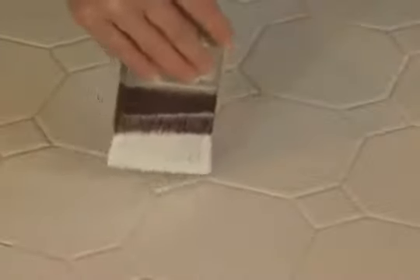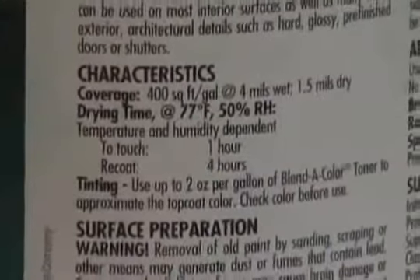The grooves in the tile can be tricky to paint. To paint the grooves and get extra paint out of the grooves, take the tip of your paint brush and run it along the groove. Then go over the tile with a light brush stroke to blend your other strokes together. When you finish applying the primer, let it dry. Read the instructions on the primer to see how long you should wait.